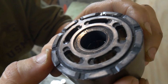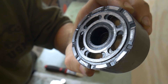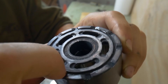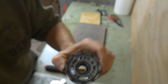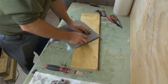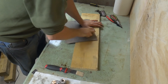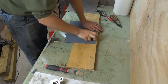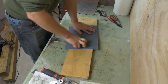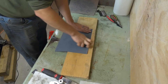This is the motor side of the hydraulic system and there are grooves in it that need to be wet sanded out. I put a little bit of fresh oil on it and used 320-grit sandpaper to sand most of it down and get it flat. Make sure you're on a flat surface and doing it in a circular motion. Then I moved up to 600-grit sandpaper to get the 320-grit marks out and make sure it was smooth. I was happy with the results.